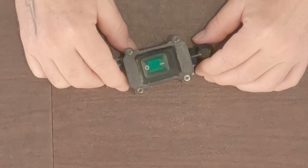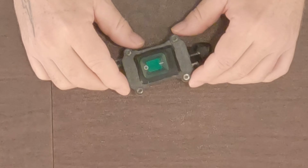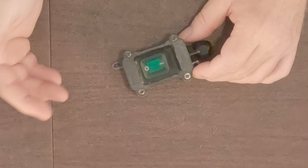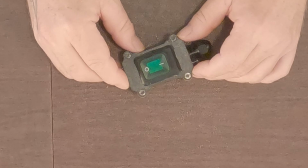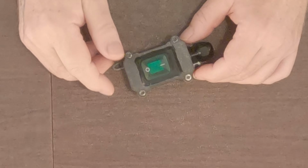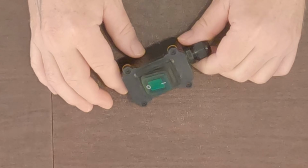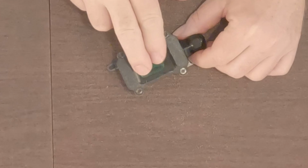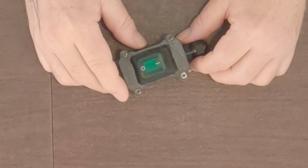You need a switch as well. You need to be able to turn power off to the system when it's not being used, and you also want to make sure that you turn power off whenever you're connecting the cable to either the dish or to the adapter that we're wiring up today. Those things have 48 volts on them, and those connectors will arc occasionally, and that can degrade the connection. Anyhow, I bought this one on Amazon. It wasn't very much. It has a nice light, so when it's on, it'll light up a green color. Easy to see where it is.